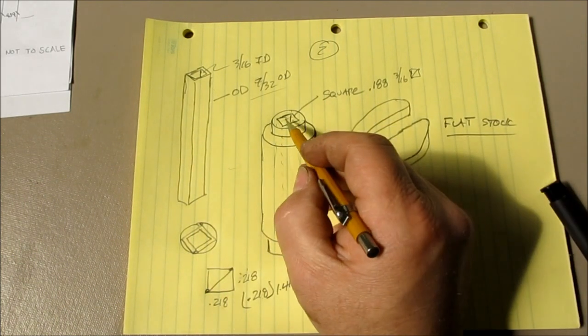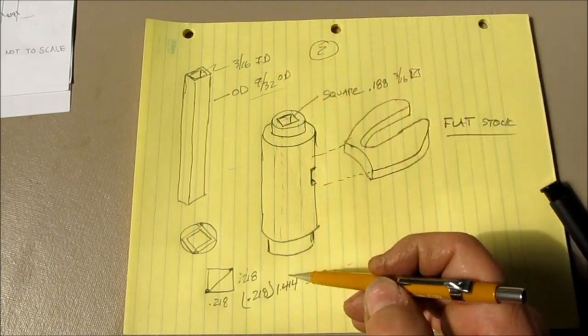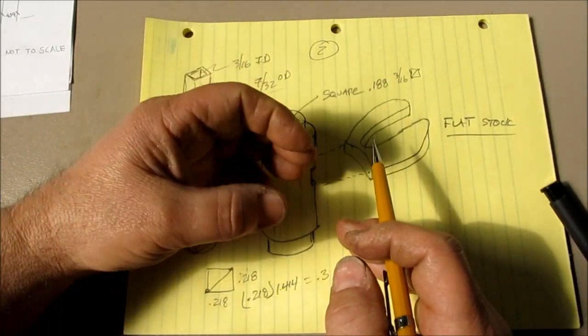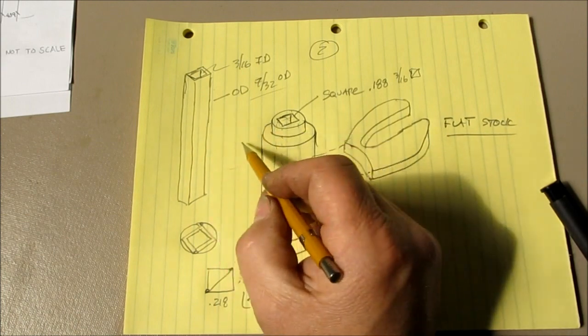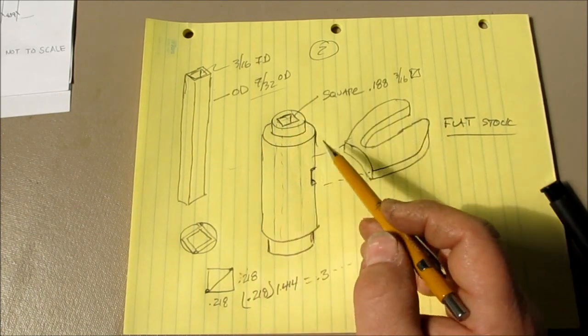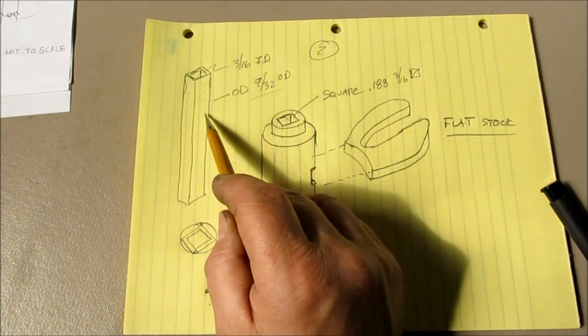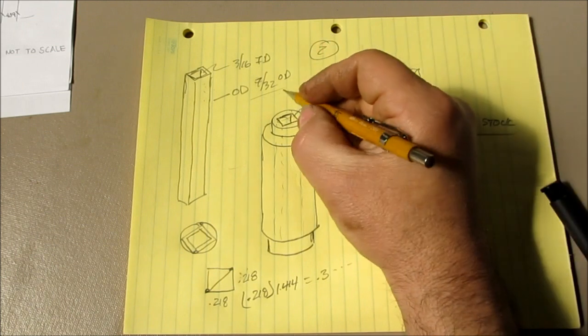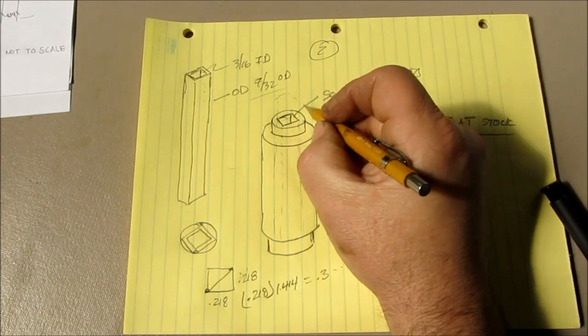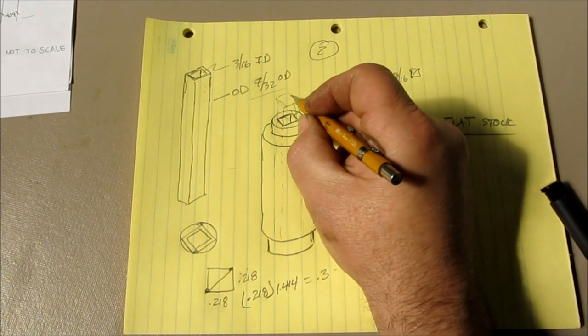And now you have a round hole through here. You slip this tube down into your round hole and orient it properly, and then you can just solder that in place when you've got it correct. My advice for when you get to soldering that is to leave this tube a little bit long, so it's actually hanging out here on either end. Oops, my sketching is going off the cliff here.